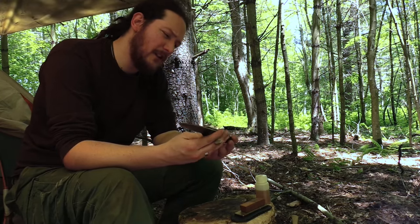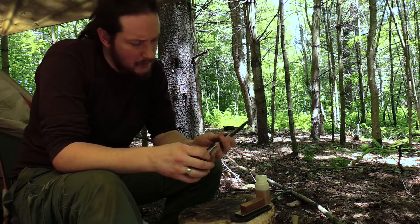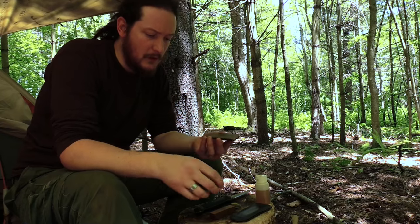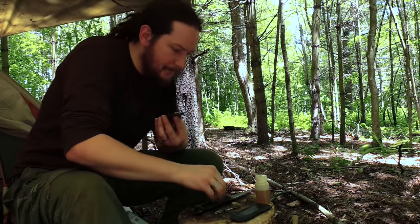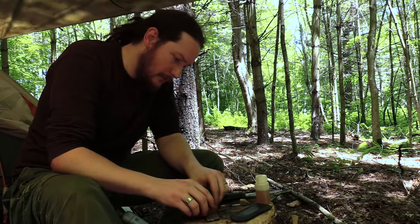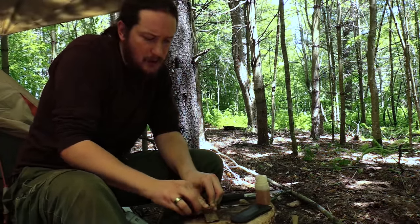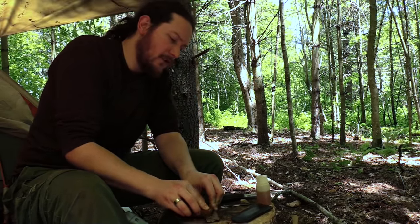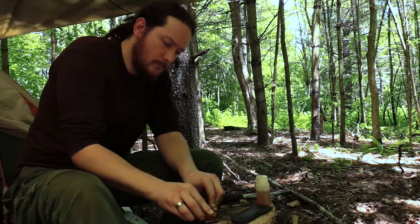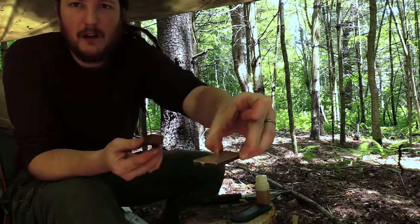A carbon knife will rust. You need to know how to properly take care of a tool so it can continue taking care of you. Next thing I do, I wet my sharpening stone — a little spit works just fine — and rub my Nagura stone onto it. Either side works, but I tend to use the coarser edge, so it takes off more of the Nagura stone. It's more efficient with my time. I do that until I have a good paste on there.